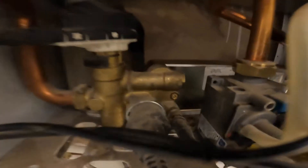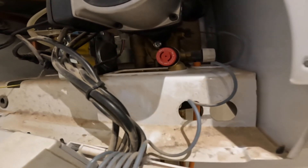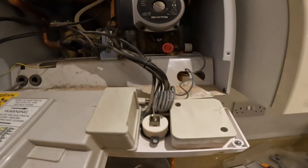That's it guys — all done. There's the new heat exchanger on the back of the boiler. It's not difficult at all — just those two screws. That should solve the problem of pressure getting from the cold water into the heating system.